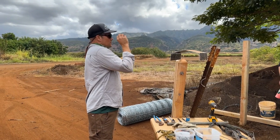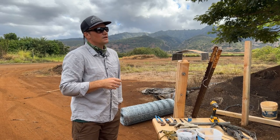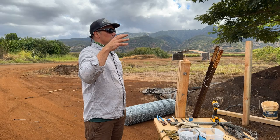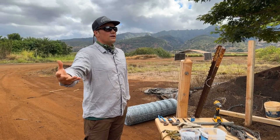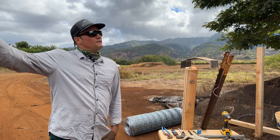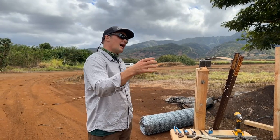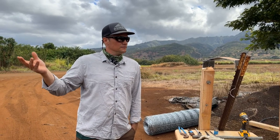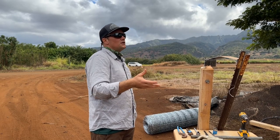For today's purposes, we're going to be demoing a wood fence post installation. If you were doing metal posts, you would be using schedule 40 galvanized posts. They're very expensive. The metal posts will last indefinitely, but they're extremely expensive. That galvanized schedule 40, two and seven-eighths post is going to last you forever. Ultimately we installed all wooden posts — treated wooden posts.